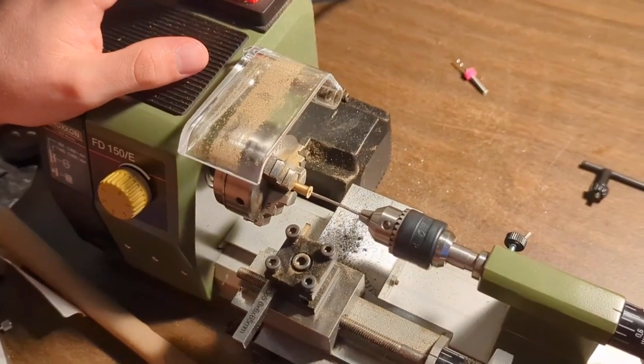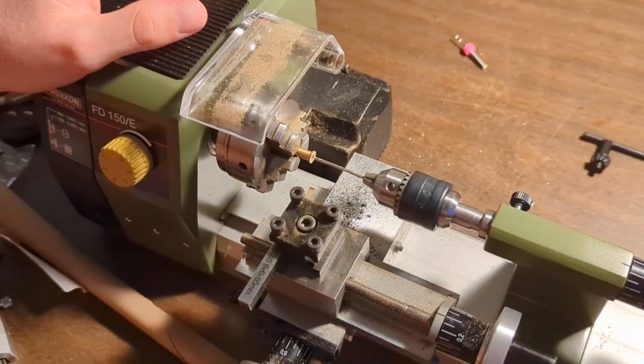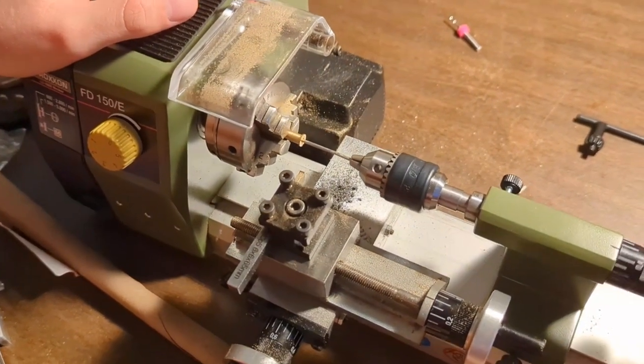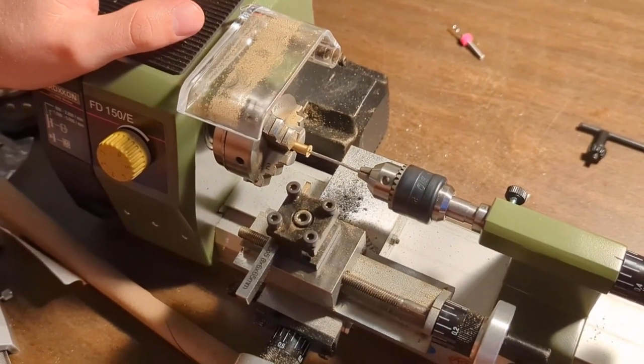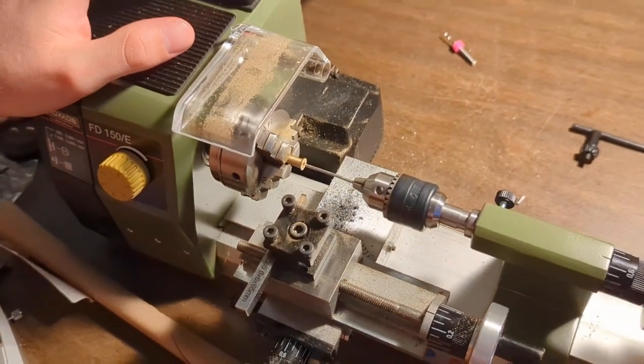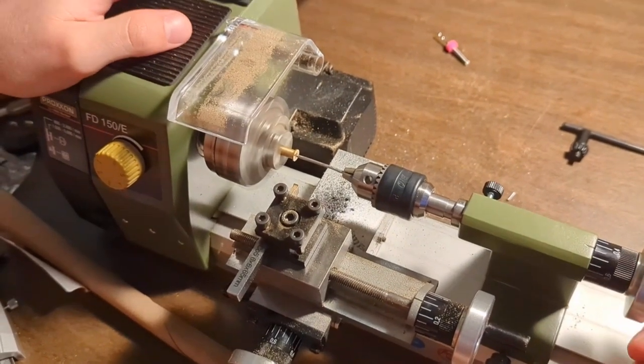Okay, so we're going to repeat the experiment we did with the aluminum and the molybdenum, now with a 1.7 millimeter drilled hole in brass stock, using the same type of aluminum, 6061, that's 16 gauge wire, or about 1.6 millimeter OD. So if you do the honors, Sam, you can... There you go, we're gonna see if we get it to weld.